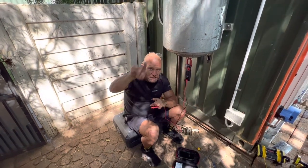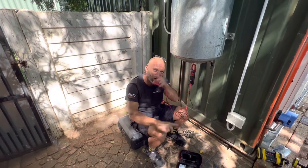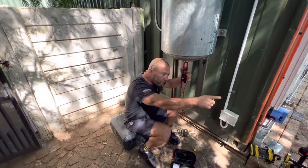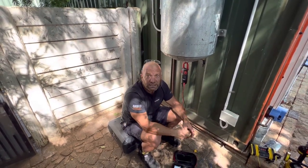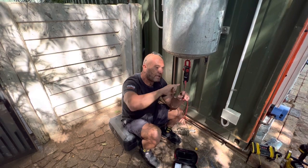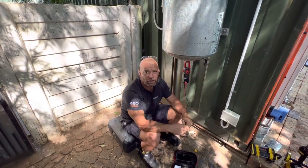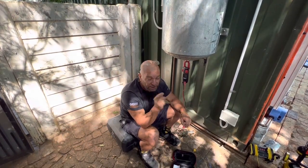In America they've got 60 hertz. The magnet in the generator has a north pole and a south pole, and every time that magnet changes poles, you get this expansion and contraction — that's why it's called alternating current, because the power is going forwards and backwards. In our utility location video we'll talk more about alternating current. Every time the magnet at the generator changes polarity, you're getting this expansion and contraction of the electrons, and you're getting 50 cycles per second. Those harmonics can be traced.